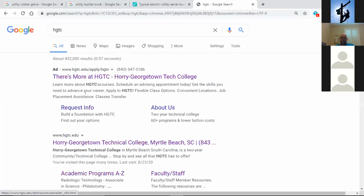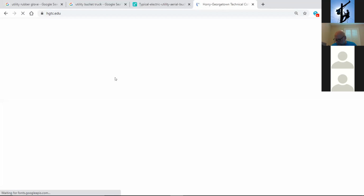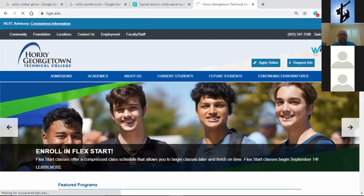And while you're looking that up, I'm just gonna say, just like that picture of that truck, one of the guys that I worked with after I left, over in Sumter, was working storm trouble in a bucket just about like the one that you showed. And it was raining, which he shouldn't have been handling the energized conductor in the rain anyways, but he did. He grabbed it. He actually had his raincoat sleeve over the outside of the rubber glove, not tucked inside of it. And it tracked across his rubber glove, across his raincoat, through the bucket, to the ground, and it held him there, locked his muscles up, and he couldn't move. The guy in the bucket next to him took his fiberglass stick and pushed him off of the conductor. And everything just lined up perfectly for an accident that evening.